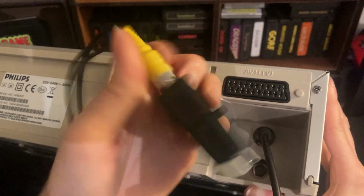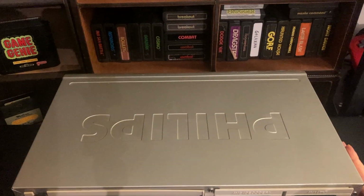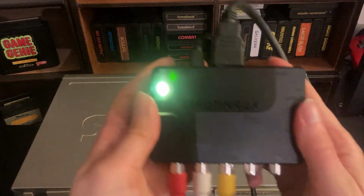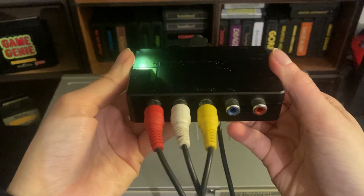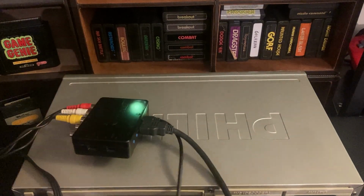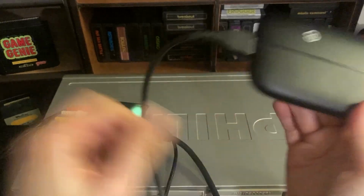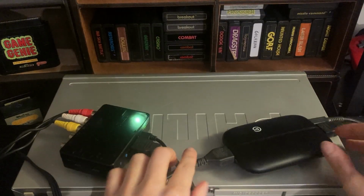Now, since we can use a different cable, if you are planning on using a flat screen or using a capture card, I'd advise adding a line doubler to the mix. CRTs often handle lower resolutions much better than flat screens, as more modern screens often focus on bigger resolutions. So many flat screens expand smaller resolutions like what the Atari 2600 sends out, and this also makes it extra blurry and can often add lag.